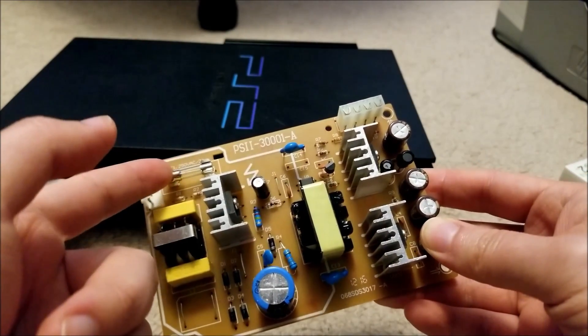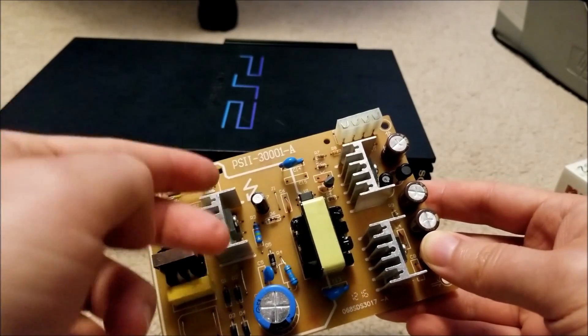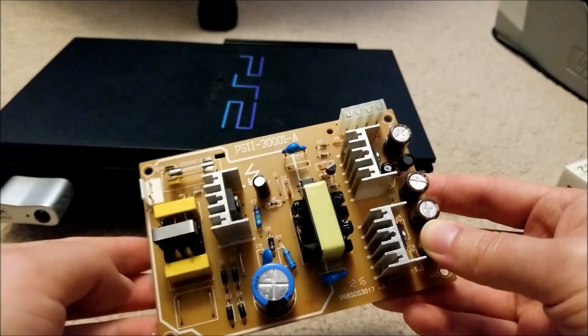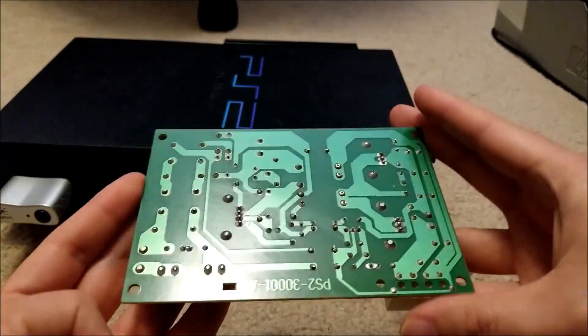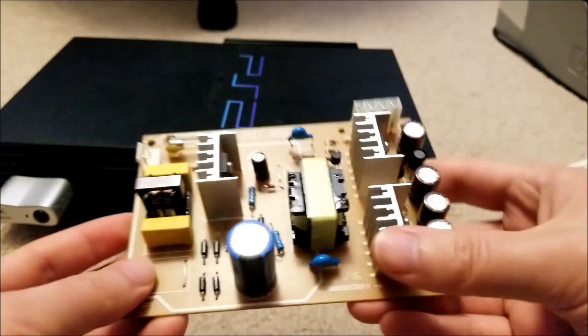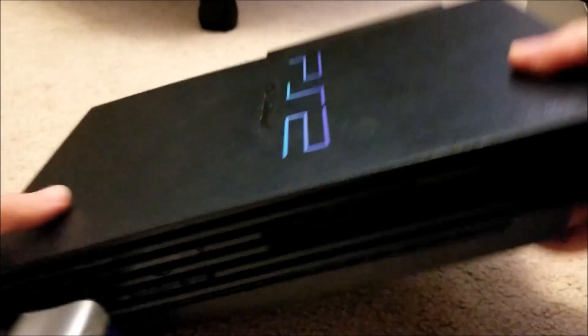So the first thing I did was check the fuse — that was blown. Then I measured across the DC link and there's pretty much a dead short on that, so I knew that was a no bueno. Anyway, this guy was pretty cheap, so instead of messing around trying to fix a dead supply, let's see if we can get this guy open.